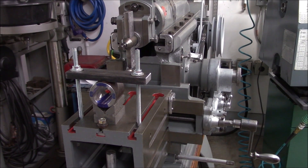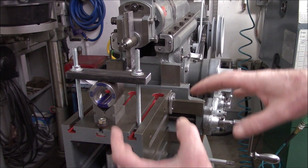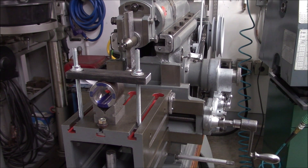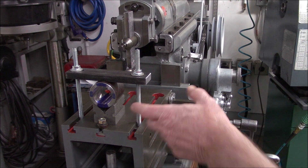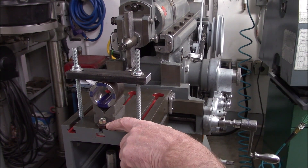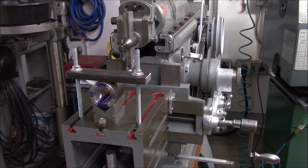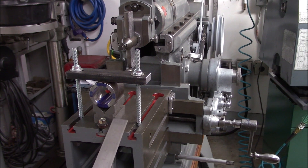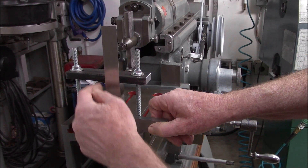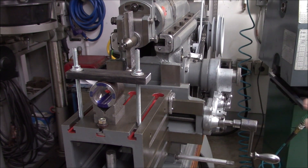Well guys, it's been a couple of hours, but hopefully this is going to work for us. I tried a couple different configurations with the vise, remounted it long ways, a couple different positions - I just didn't like it. So I rummaged around and found some 5/16 all-thread, made a cross strap, got a V-block, got a little poor man's stop block out of a spacer, a piece of threaded rod, and a T-nut. I came in with a square and squared up the V-block, and lined up our center line. I think we're ready to go.